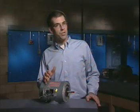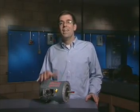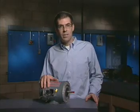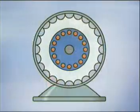The first thing you should understand about an induction motor is that it's basically a transformer. In fact, when Nikola Tesla patented the induction motor, it was patented as a rotating transformer. To understand how a squirrel cage motor operates, assume that a squirrel cage rotor is placed inside the stator winding